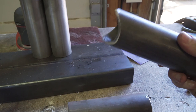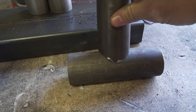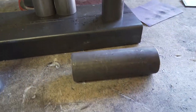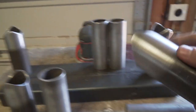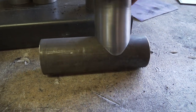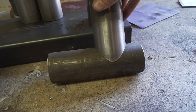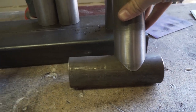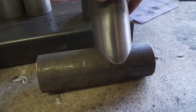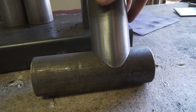What I normally see on YouTube is people will notch their tubes, clean them up real quick, and then tack it together and just weld it up - which is not necessarily the best way to be doing things because usually tubing does have mill scale on it, so you want to get that off before you actually weld. Another thing I see is people will not even put a bevel in their tubes and they'll weld it up like this. This right here would be a good joint for TIG welding because it's nice and tight, but for MIG welding it will just cake up with your MIG weld because it's actually pushing wire into it instead of TIG welding where you can manipulate how much wire is going in.